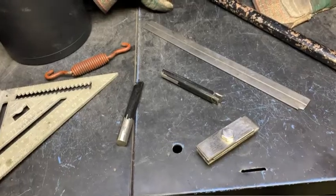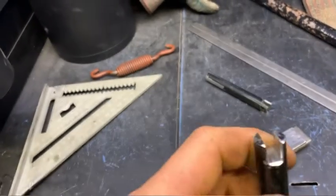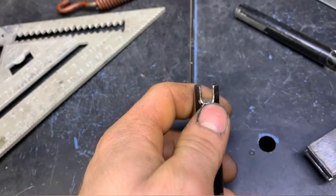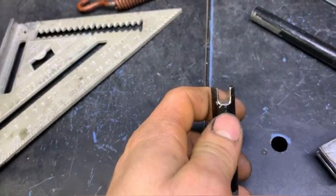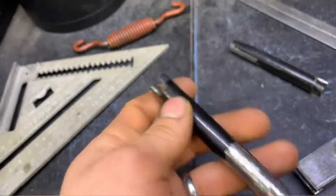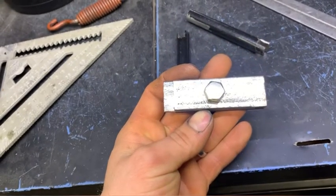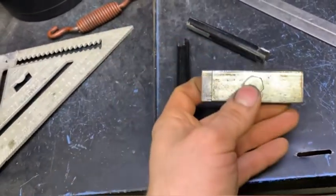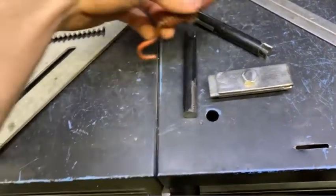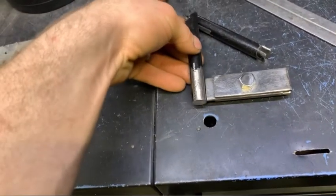So here's where we're at. I went ahead and cut that tire iron - just cut on either side with a cutoff wheel, then wallowed it back and forth to cut out the center, and took the bit off with a die grinder. I trimmed this down on either side so it's about three and a sixteenth, which is pretty much perfect for how this is going to be set. I'm going to get these tacked on there and weld it up, then work on cutting the pipe for the handles.